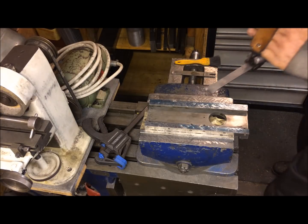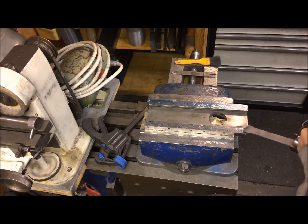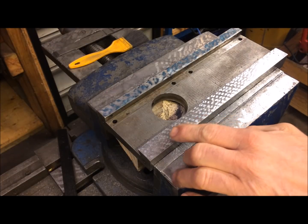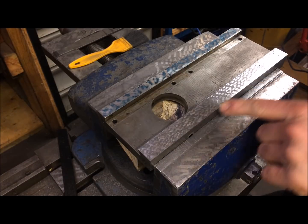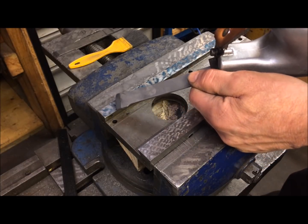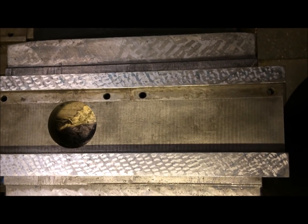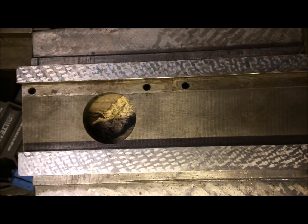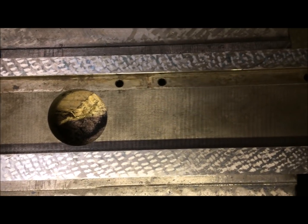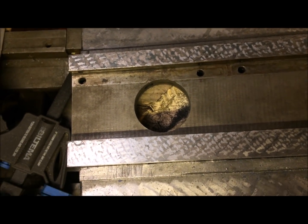As I said, you can't beat the machine. You're supposed to only hit the blue spots. I wanted to make one pass both ways to even out, but you're supposed to cut the blue spots into two. You go the usual way — rows — and you get individual points very easily with the power scraper. You can do it hand scraping also, but you have to prove it's flat and get it all covered. It's very hard without spending an awful lot of time to get this kind of pattern at this level without power scraping it. But that's the benefit of a machine tool.